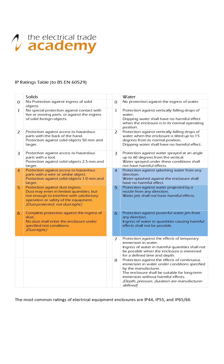Here's a very handy reference table that helps us understand what IP44 actually means. The first digit specifies the limits of solid element ingress such as fingers, tools and dust, while the second digit concerns water ingress. The higher the numbers, the more protection an enclosure has. So for an IP44 rated product, this means it's designed and manufactured to guard against solid objects greater than one millimeter in size and splashing water such as rain.